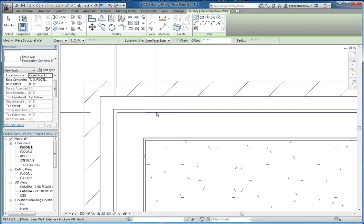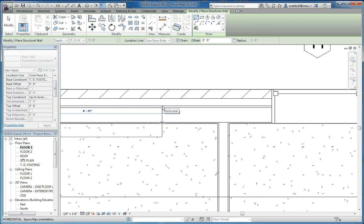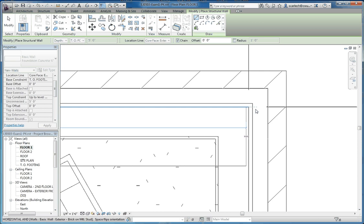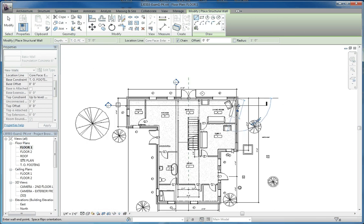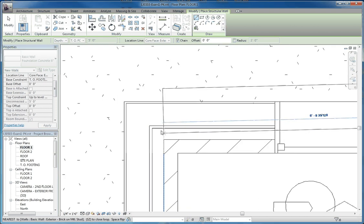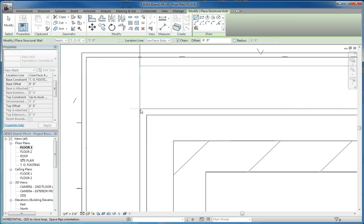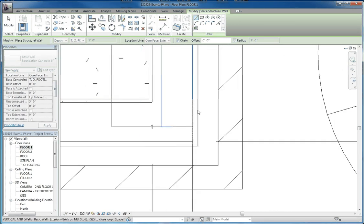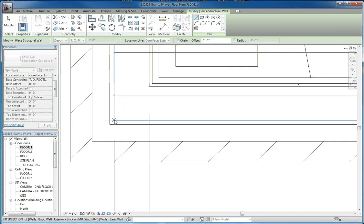Let's see if we can pick up core face exterior. We want to pick the exterior of the core — the core is over here — and try to get as close to the edge as we can. There is an intersection over here and we're going to sketch that out. Notice when we sketch that out you can see the 12-inch wall. It extends into the floor. Once we get to the other end of the wall it'll become apparent what we're doing — we're going right to that intersection. You'll notice that's the edge of the wall, so we can actually see it. If it terminated on the other line, we would not be able to see it and there would be no confirmation that we're actually sketching a wall in the right location. It's kind of hard to pick up that intersection, but if you pick up that wall, it snaps into place. Make sure to extend your cursor out a little bit to pick up that element if needed.